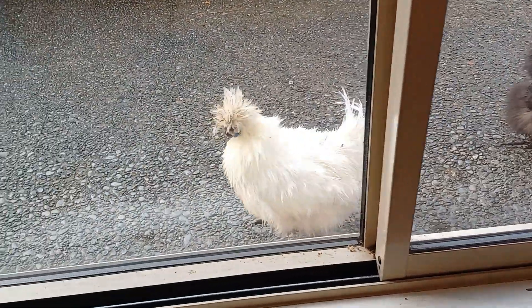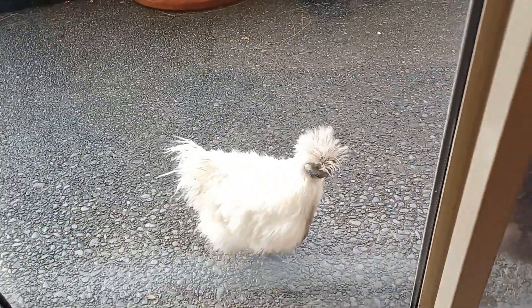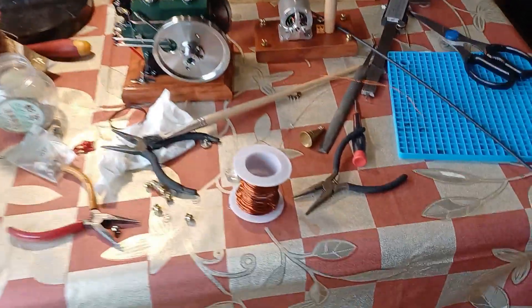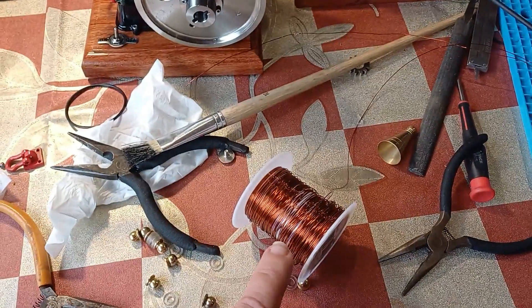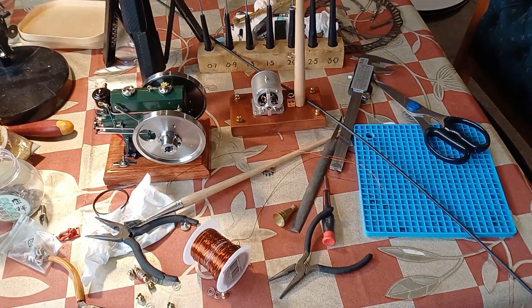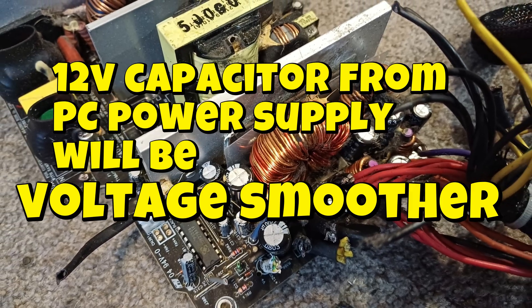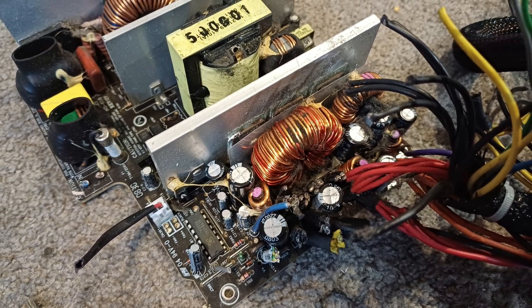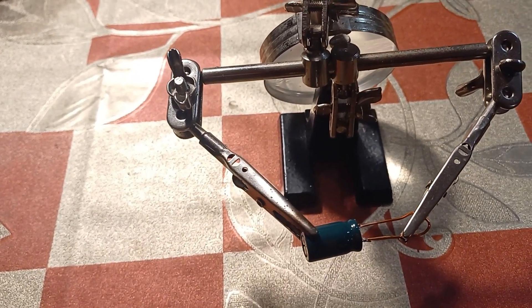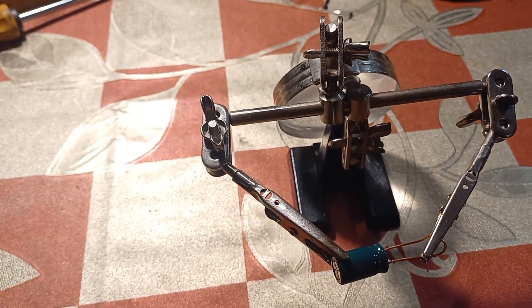The weather outside is horrible, hence the soggy chickens. Sorry guys, I can't control the weather. But here inside we're finishing up our little project with the generator. I've finally bought some stuff — this is the only bought stuff: a little bit of copper wire and a connector. We need a capacitor on our dynamo; the one I've got is out of a second-hand power supply and I need to extend the legs. We need a capacitor because I'm going to use this 1890-ish looking dynamo on hit-and-miss engines, so we need to smooth out the power a bit. And it might help our LED not burn out.